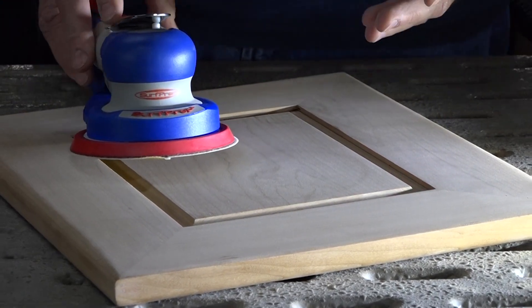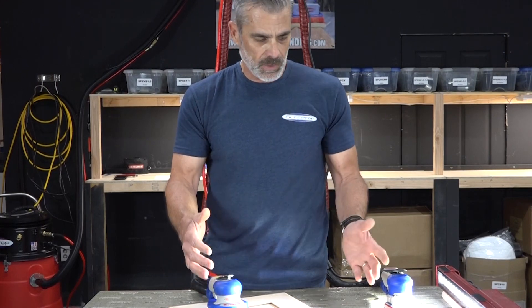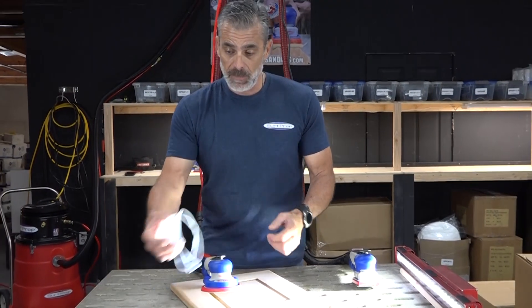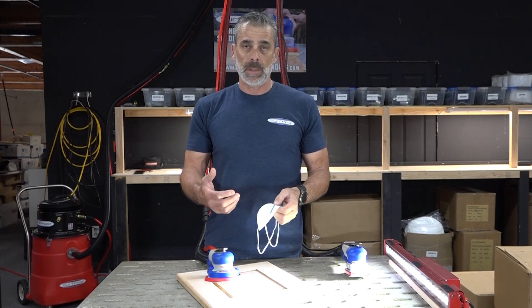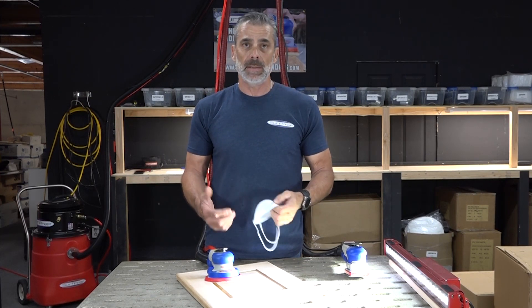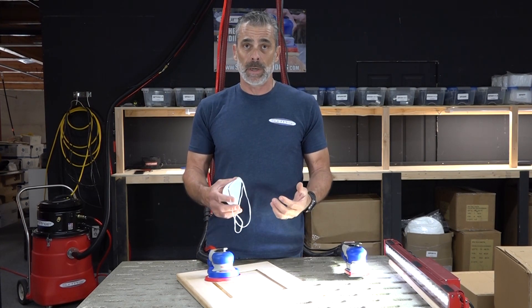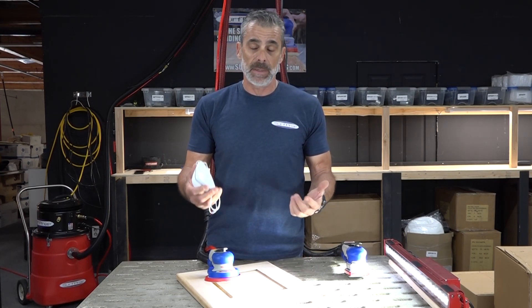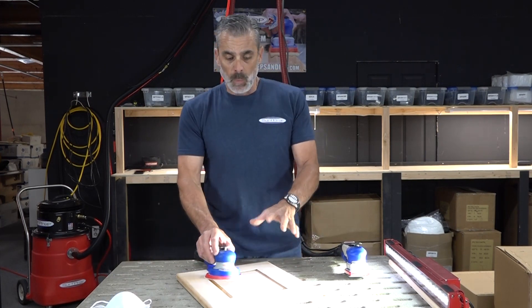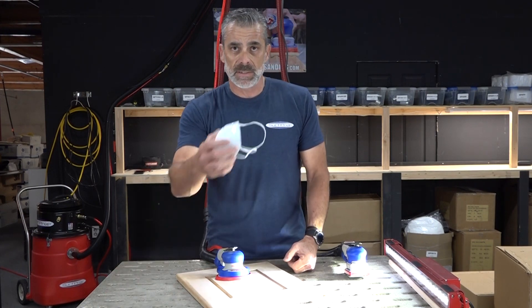The purpose in this was to show you that when we're running central vacuum on either a 5-inch or a 3x4, we are picking up all of the dust. A lot of you are probably familiar with a dust mask — not a bad thing to have around — but in the summer months in the south there's a lot of humidity and wetness. I've spent a lot of time in thousands of shops where in summer the humidity is so bad that wearing a dust mask can be frustrating. So what we want to do is create an environment where while you're sanding you don't necessarily need one of these.